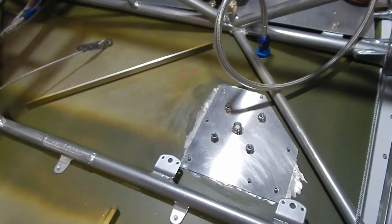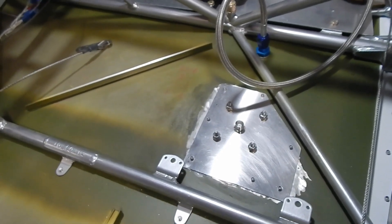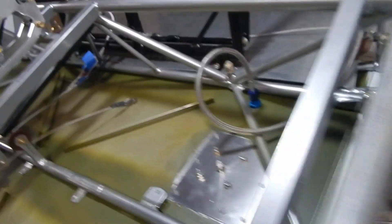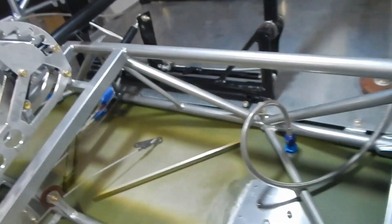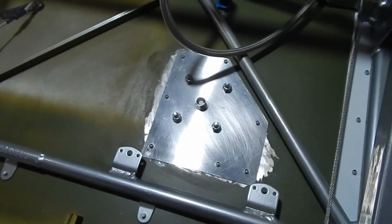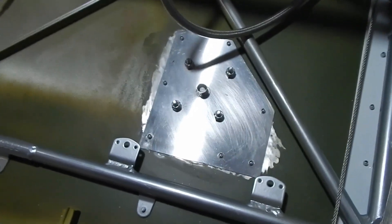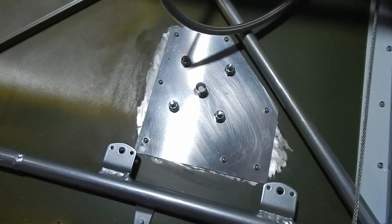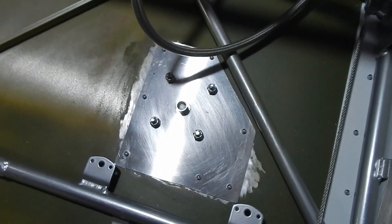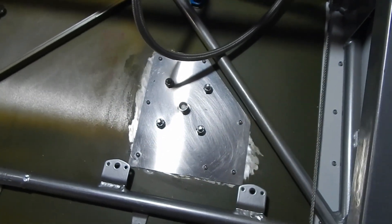I've finished the COM antenna — this will be my COM 1 since it's on the bottom of the plane. I used number 8 stainless steel pan head screws, stainless steel nuts, brass washers, and I've got basically 0.002 ohms resistance on the nuts. It's all set.